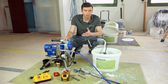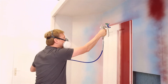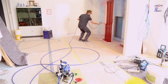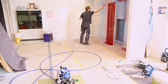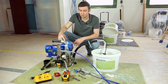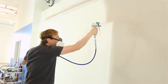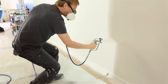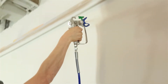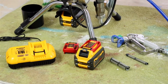Regarding the materials you can spray with this machine: it is meant for thin materials such as lacquers, stains, and varnishes, up to thicker materials, more or less exactly like the GX21. Indoor dispersion paint remains the thickest material you can spray with this machine, so up to a tip size of 521.